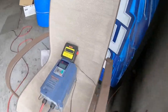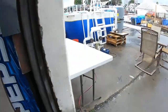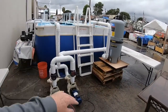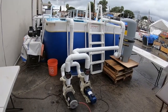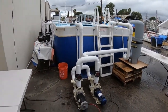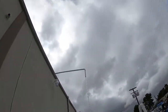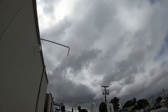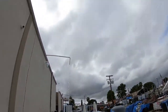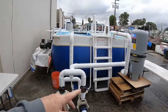Right now we are at 135 to 136 gallons a minute. The AC pump is only using 27 Hertz. So right now you're saving probably about 40% that you would normally not be saving. Since we have this hybrid setup, we're saving close to 40 to 60%, and at this particular moment about 70 to 80% savings without the sun even out. When the sun pops out, the AC pump will just be turned off pretty much all day.